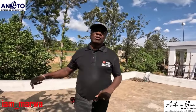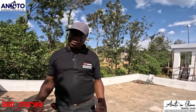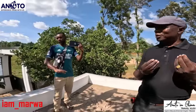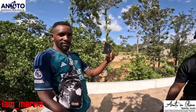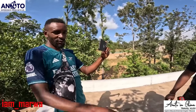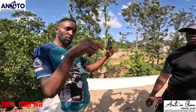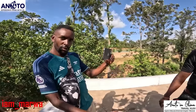That one you do on the foundation. Foundation. Not on just the roof. Just to protect the dampness from coming down through. Yes. So the roof, you put the timbers. The moment they remove the timbers, that polythene leaves, as I was telling you. So they need to make this concrete like soup type. That polythene helps it not to penetrate. So when you vibrate, that soup won't go down.